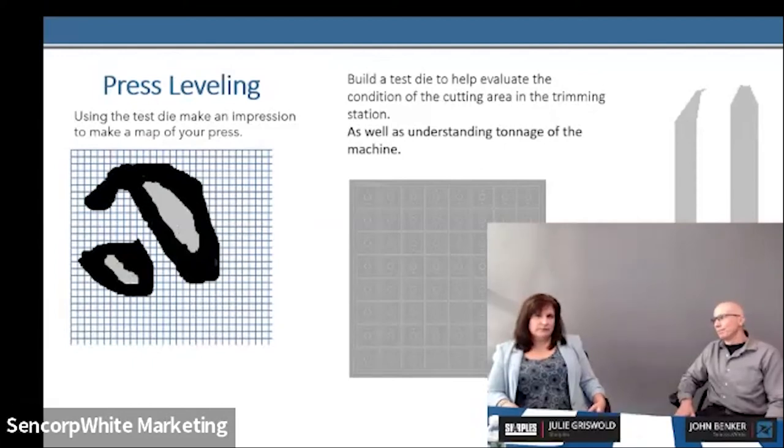The tonnage on the machine is asked a lot—how many up can I run this job to maximize yield? Geometry is a consideration; getting one more row could mean getting the job or not getting the job. We understand and want to see you get the job. Information is definitely your track record: understanding your machines, understanding your experiences with the material and how much you can push. But as John mentioned, over time you need to keep an eye on wear of the tool to know whether you've got enough edge to cut properly.